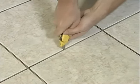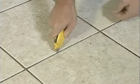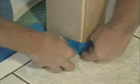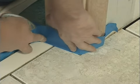To get ready for grouting, you want to go over the floor and make sure there's no thinset poking up between the joints. Hopefully you cleaned most of this out as you were setting the tiles. Now you want to protect any woodwork or carpeting so it doesn't get stained by the grout.